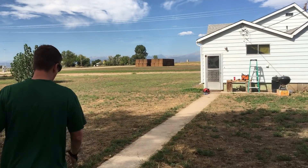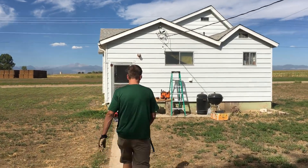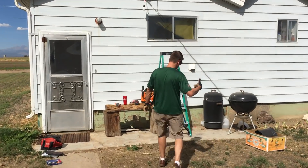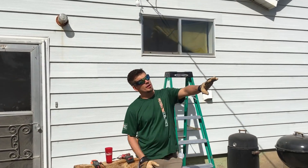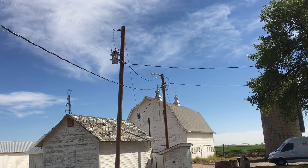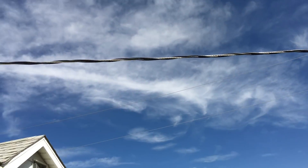I got this turned off, and then I hit that knife and turned it back on. As you can see right here, that was a knife disconnect with no fuses. Power comes up, goes to the transformer. There is no overcurrent protection — that's why it's not doing anything other than arcing inside of that disconnect.